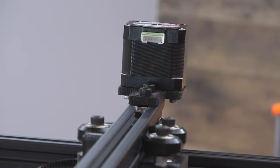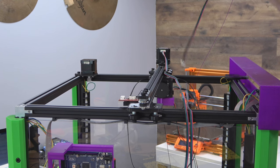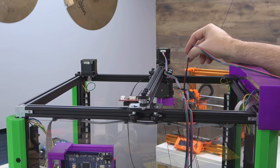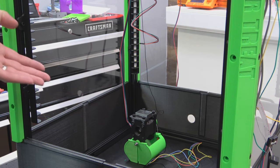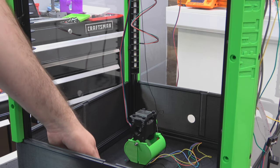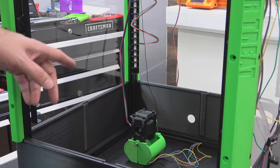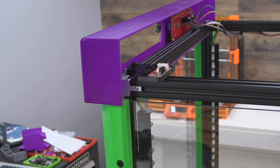Now while we're running all these cables, we are going to need one for the claw, of course. It's going to travel down the same path right past your Z motor to the claw cable, but there's going to have to be some slack — you're going to have to leave enough slack for it to get to the bottom of the machine. The claw actually sits pretty nicely on its claw on the bottom, so that will give you an idea of how long that cable needs to go down in there. You're never going to want it any longer than that because whatever you're trying to grab is going to sit on top of that base. There's no end stop or anything — that's the only wire that needs to go down there. You can zip tie that off right now to the Z motor holder — that holder we attached to the back of the motor — just so that you always have the same length.